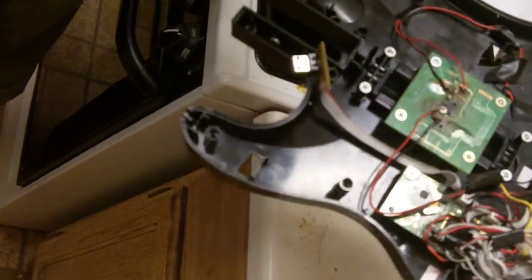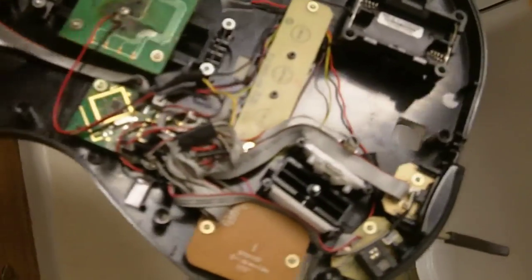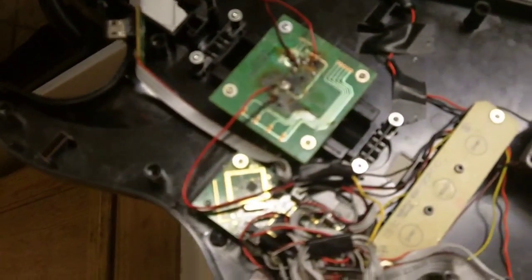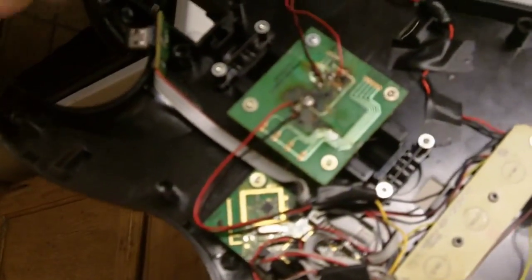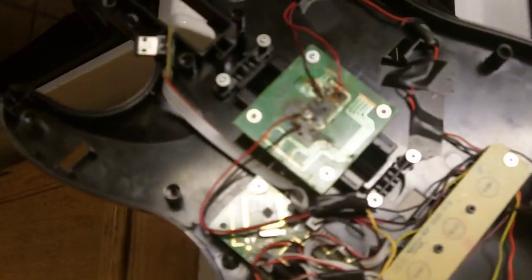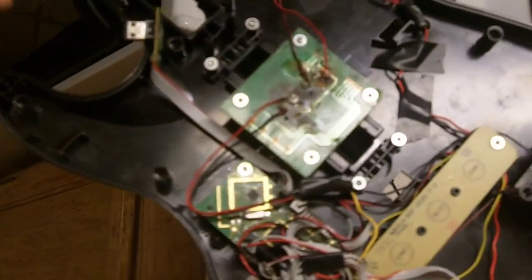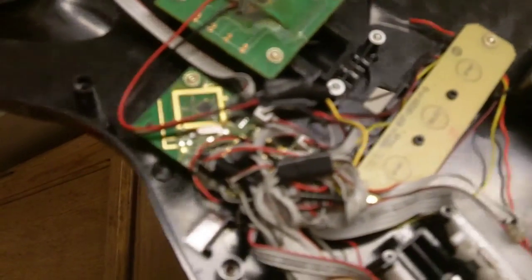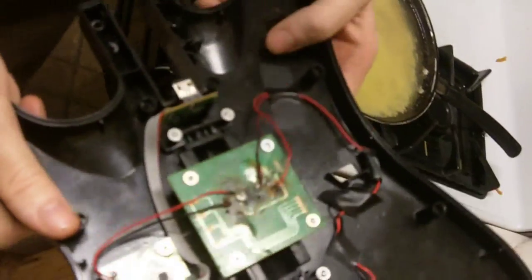So that's how you fix both those issues on the guitar, and this should apply to most Guitar Hero guitars. If you just have mild corrosion on your chipboard — corrosion usually looks like a white flaky thing, but it can vary, including flaky brown — try taking a pencil eraser and rubbing the connections to see if that doesn't help you without going through this whole process. That might fix your problem, but the corrosion will likely come back. These things wouldn't happen if people kept their guitars in a drier area, though I get that some people live in high humidity areas.